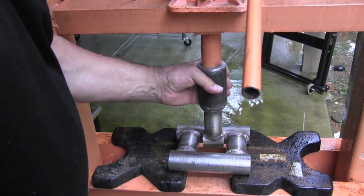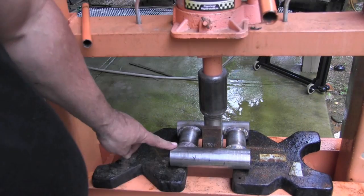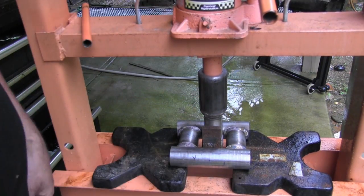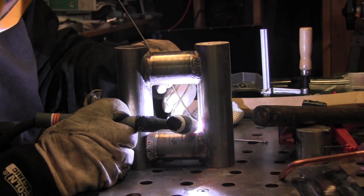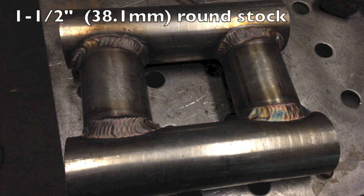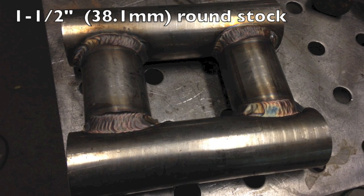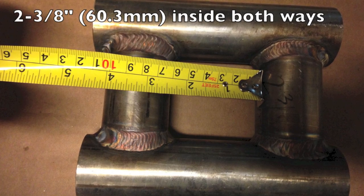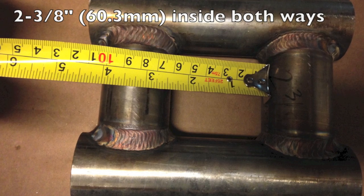This is the bend test fixture that I'm working on. It just goes with a 20-ton Harbor Freight press. Very simple, down-and-dirty bend test fixture for bending test straps out of plate and pipe, and it is using dimensions right out of American Welding Society D1.1 Structural Welding Code. There are different dimensions for different codes, but this is pretty close. I'm not going to be using it to officially certify anyone — I just want to be able to do some demonstrations on videos. Once I weld a test plate, I want to be able to show that it's actually good, so I'll bend it, and the dimensions will be very close.